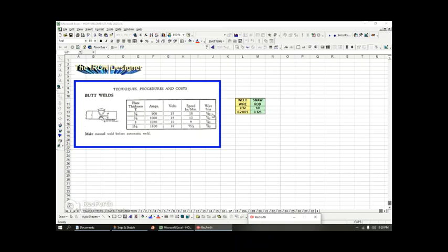Okay. Now this is the important part. The weld wire size, 7/32. Well, how big is that? Well, I did this little table for you right here. You see, 7/32 would be 0.218, around 0.219, close to 0.22, all right? So it's getting thick. It's almost like a quarter of an inch, right? 0.22. Well, when we're doing hand welding, our weld rod is only 1/8 of an inch diameter, okay?